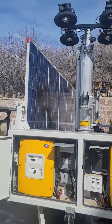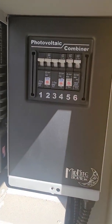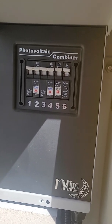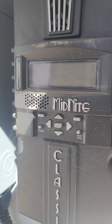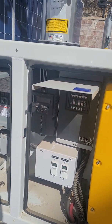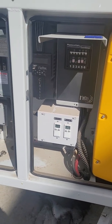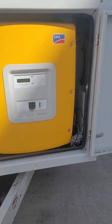The next video is about what to do when you get your trailer. There are several tasks that need to be done, and depending on the state of your trailer, those tasks might vary. This trailer is a good example. Despite the combiner switches all being on, the Midnight Classic is not on — the voltage available from the batteries is not enough to power it up. We're going to have to do some things to the batteries to get those voltages up.